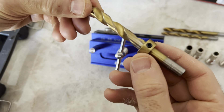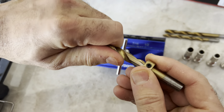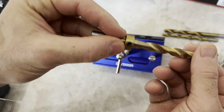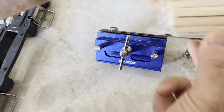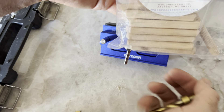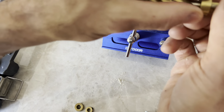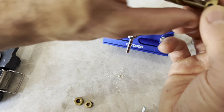They also provide you with these lock washers here, which allow you to pick the depth to which you want to drill the hole. I was using three-inch dowels, so I wanted to go about an inch and a half and a little more in each side. I measured that using this lock washer.